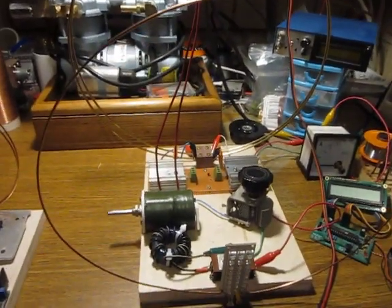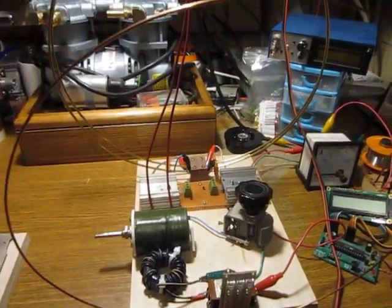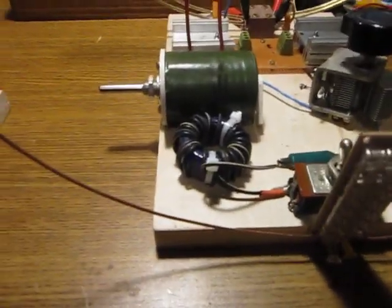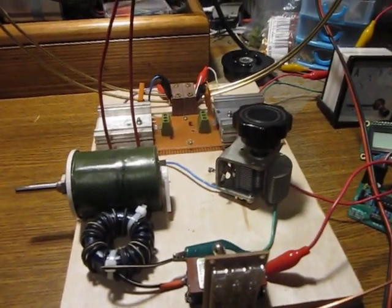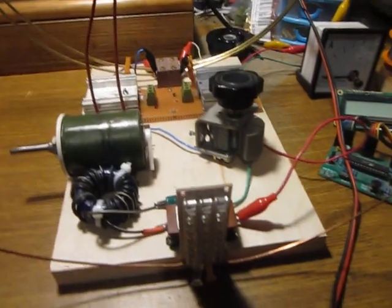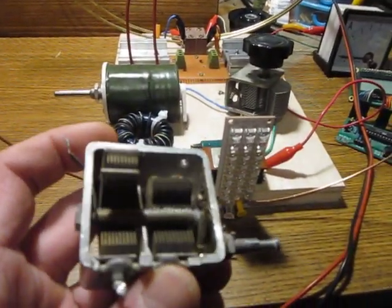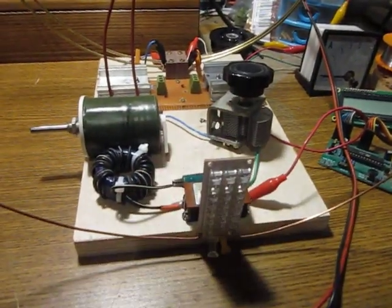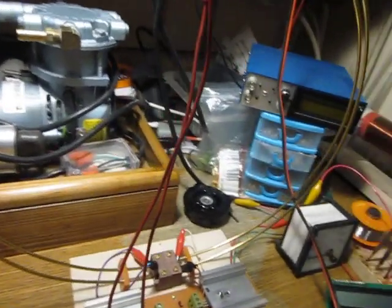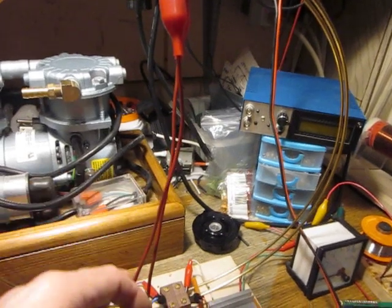Okay guys, this is the first setup. I haven't changed anything. There is still a choke. I replaced the capacitor. I had a two section capacitor before, and I have far better tuning with this one, and the wires going to the center tap are old test leads,